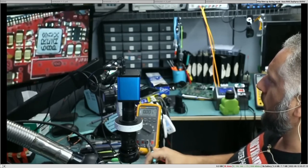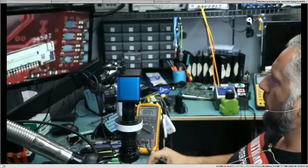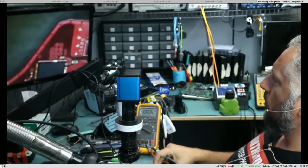Next is a quick visual inspection to see if anything is burnt. Visual inspection is always good when you have a board — I would say do it first, even before checking any voltage. You never know what you're going to find: liquid damage, a missing component, blown or discolored components, whatever.